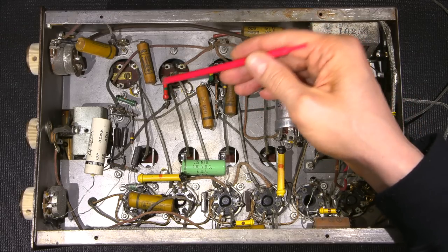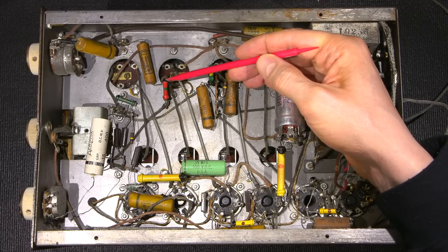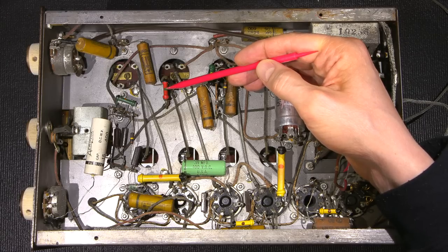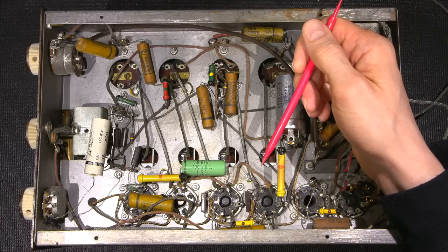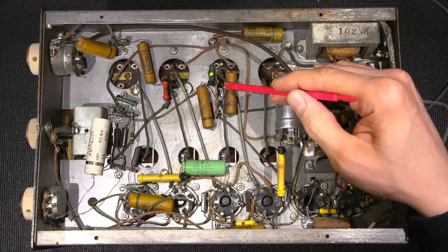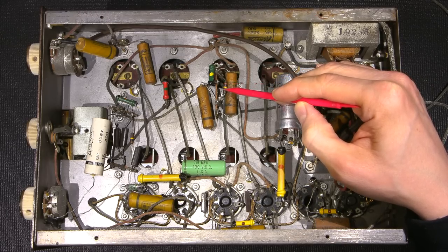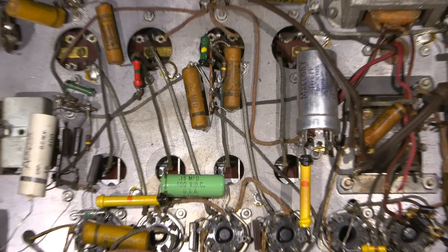And in this case here, you can see that the body is red, so that's 2. The end is black, which is 0 again. And then we have 5 zeros here, which is green, so that's 2 megohms. Things like that. So very easy to read these things. Lots of roundies in here. So all the roundies would have to be tested. You'll notice on the roundy resistors here, there is no fourth band. Actually, zoom in on that just a little better. I will have to touch up the focus here.